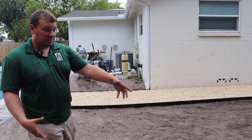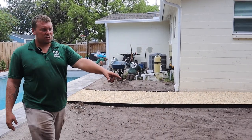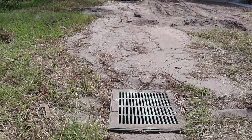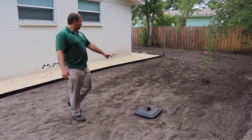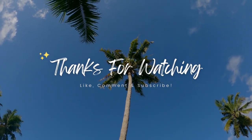Connected to this vault is a big six-inch drain pipe running throughout, connecting all the downspouts on the house and funneling everything into here. All the water collecting on the house and in the ground goes to this basin, where it can eventually percolate into the ground. We also have an overflow out to the street in case it gets full — you'd need a really big rainstorm for that to overflow. This is what makes aqua blocks unique: normally we use them for water features like urns, spheres, and ponds, but we can also use them for drainage and water holding.